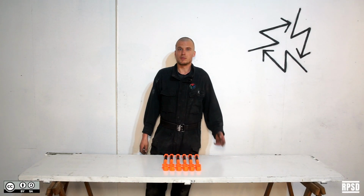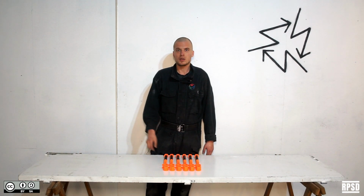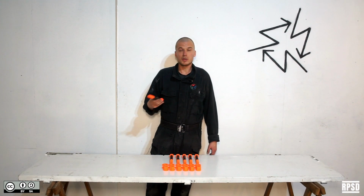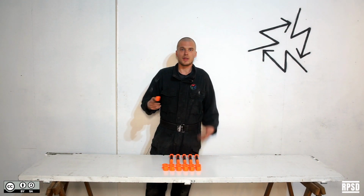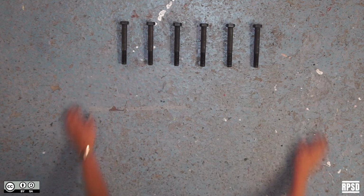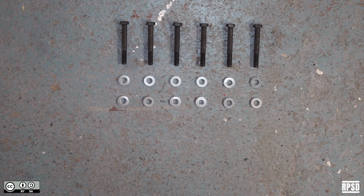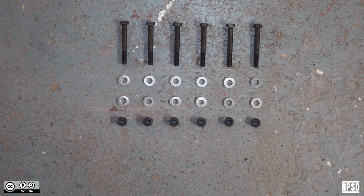The final part of the mold body is the fasteners, which will hold the whole thing together. We went for M20. They're nice and big and strong. We also chose 12.9 grade steel as it's strong and durable, and they're going to be opened and closed many times. You're going to need some M20 by 250mm hex bolts, some extra thick M20 washers, some M20 flange nuts, and some fluorescent paint.